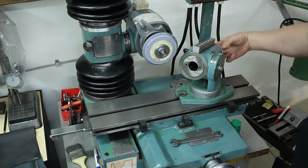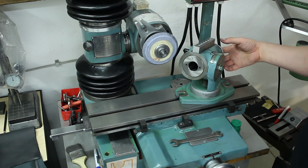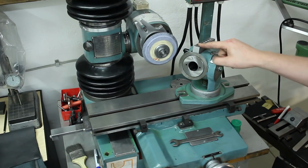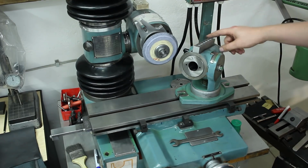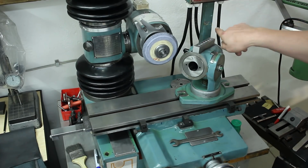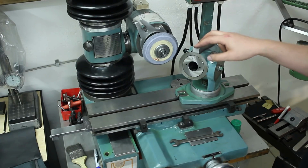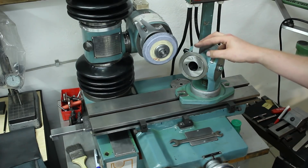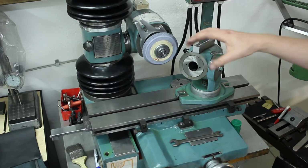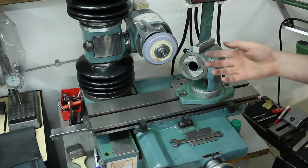I already machined a recess back here that will hold indexing plates. I machined a flat here on the top of the dividing head, and I screwed on this 20 by 20mm rail out of tool steel. It has a row of 6mm tapped holes into it, and this allows me to mount, for example, the index finger arrangement when I want to use an index plate. It can also hold a support finger for tool and cutter grinding, or a dressing diamond, or a microscope to view the actual grinding process, or to hold my camera for filming or whatever.